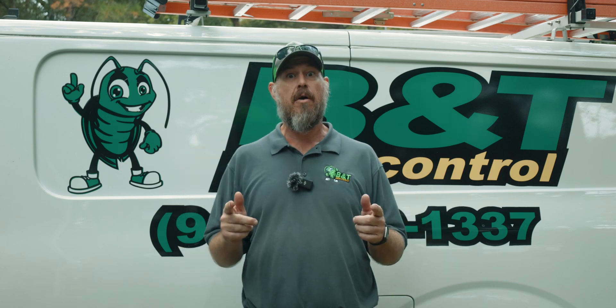Here we have Nick digging a trench about six inches by six inches, enough to hold material by the foundation wall in our target areas. Something you always have to be careful of is any penetration under the ground — you don't want to do any damage to plumbing or wires. Always watch your surroundings. Our goal is to get treatment around the full perimeter of the house. In areas such as a slab where we can't dig a trench, we're going to have to drill through to get material into the soil where termites live.